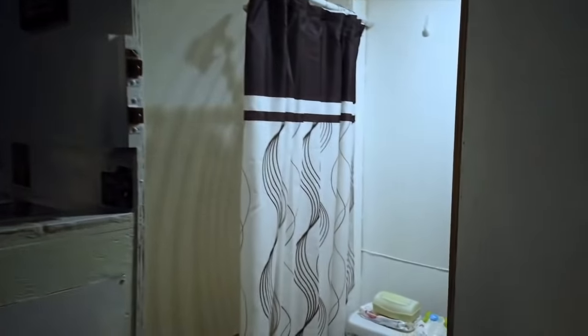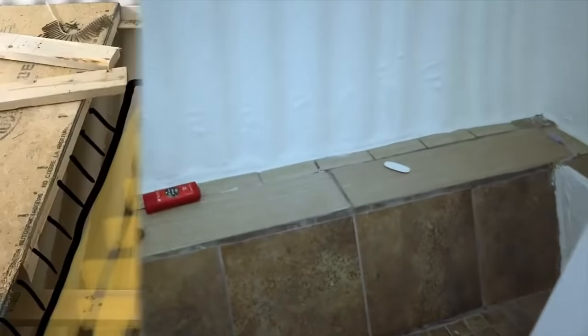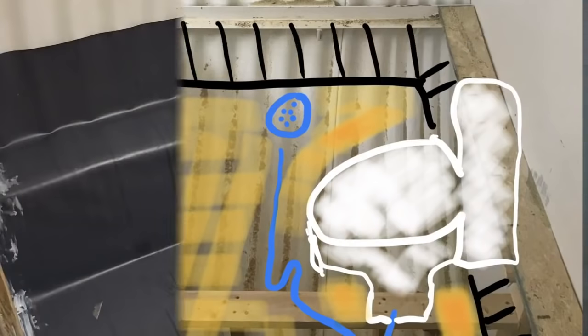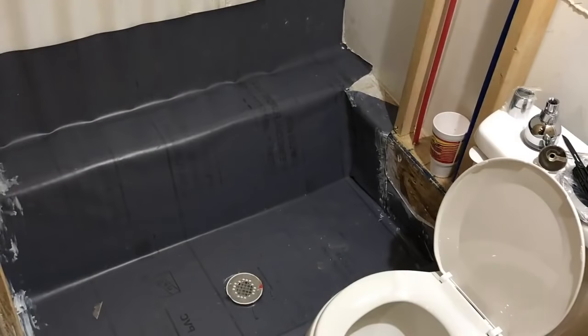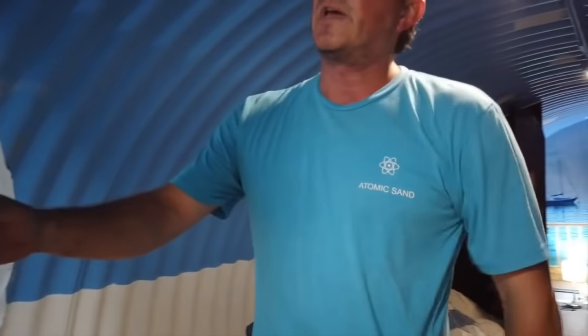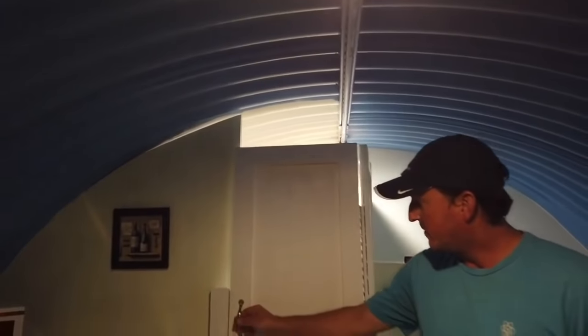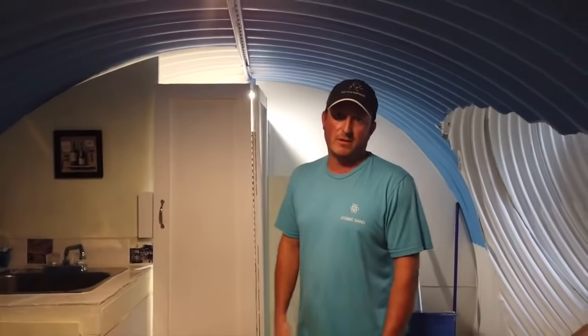So we installed a little bathroom — a little toilet, a little shower that we tiled. For the shower, we just built that out of plywood, framed it out and then put down this plastic impermeable liner, and then just laid tile on top of that. Got a little generic toilet, built these doors out of just wood, put a piano hinge right here just so it took up less space. Left it open at the top so it could breathe, since our breather pipes are on either end of the bunker. Just put a little magnetic closure on it.